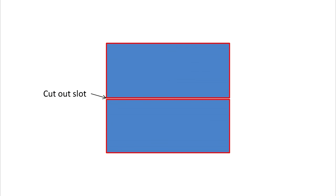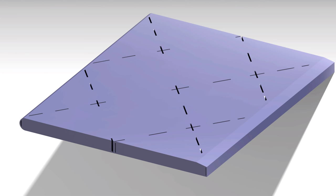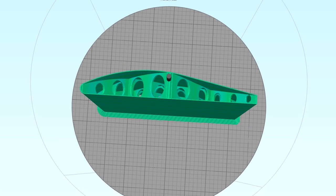Since the wing is technically a solid model in CAD and the ribs are hollow cutouts, the only way to make a hole through a hollow cutout is to actually put a solid circle through the rib. The ribs are cutouts, so the only way to make a circular hole through them is to put a solid shaft through the rib. I've remodelled the previous CAD model and this time it's got circular cutouts in the ribs. I've put it into the slicing software and it looks like it's going to work, so I'm going to start the print.